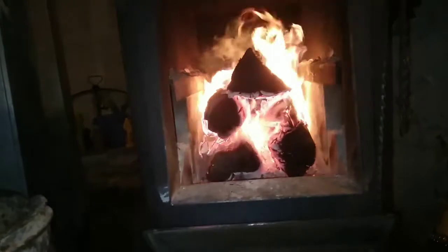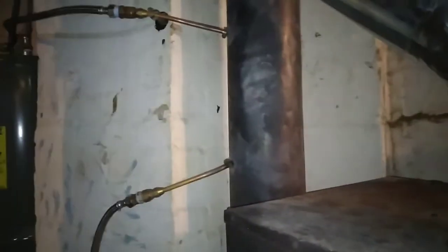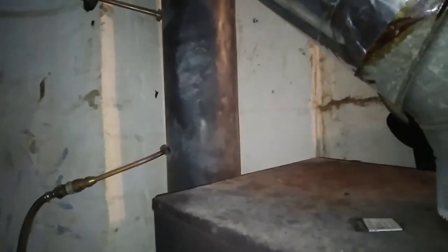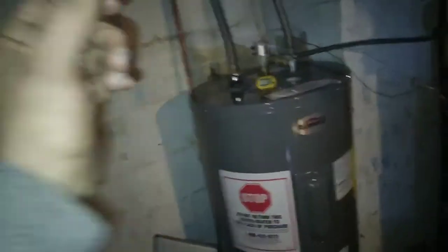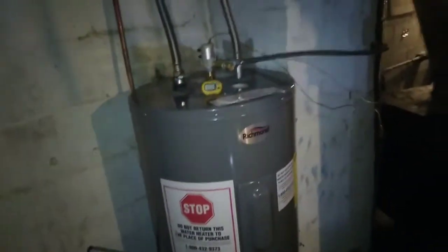Oh, fire is going. I'm just gonna let her roar wide open. But yeah, the heater coil, if you didn't see previous episodes, is 3/8 inch copper, 20 foot. It's in a 6-inch pipe. I used a 4-inch pipe and rolled the copper around that. Got it real nice and tight to the pipe, and then I stretched it a little bit so it's not touching, so the heat can get all the way around the whole coil. If you got it compressed too tight, you can get cold spots, and that also builds up creosote.